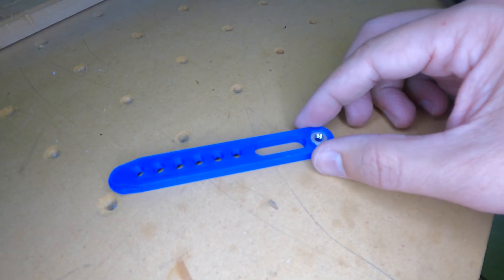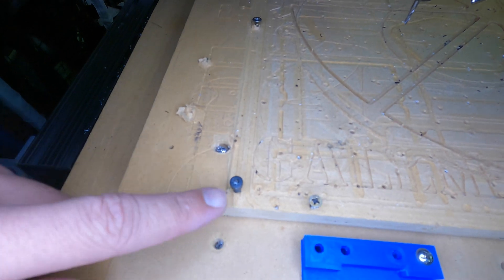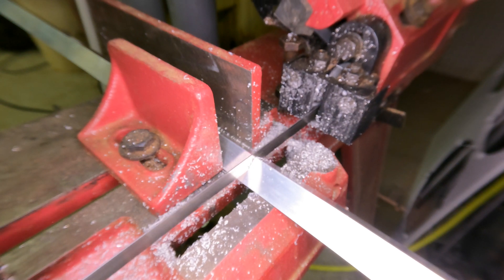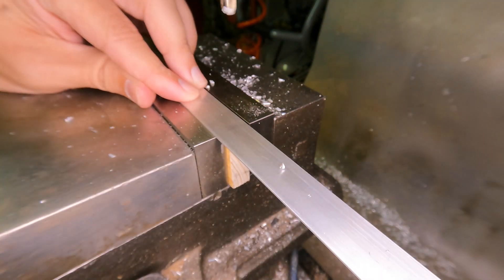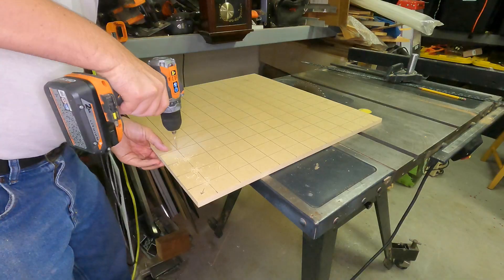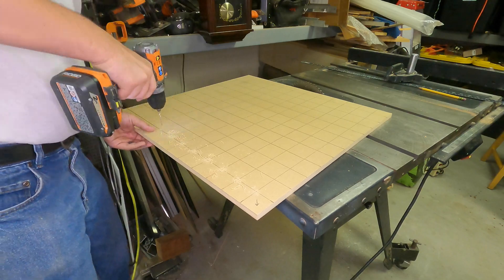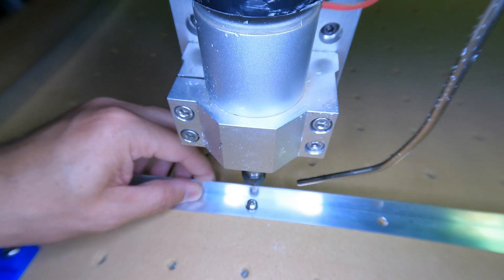Fourth, it had to be strong enough and last a long time. 3D printing is not known for its strength compared to parts made of solid material, so I had to beef it up a little bit. I would never depend on threads in plastic, so the screw on the end uses a pressed-in nut to provide metal threads. I've always had a fairly solid stop on the left and bottom sides of the part, so I'd like to keep that. These extruded aluminum angle iron pieces will work well for that — the screw holes should be oversized or cut as slots so they can be adjusted. The new spoil board is thinner but will work fine; I'll drill oversized holes every 2 inches to allow the clamp screws to go through it to the bottom board where the T-nuts are. The calibration is pretty simple — the spindle will provide the accuracy, and I'll move it to the two ends of the angle bracket and tighten each of them down.